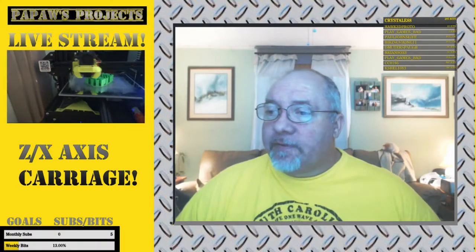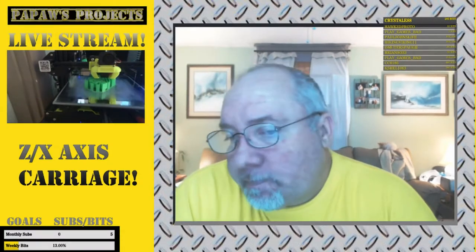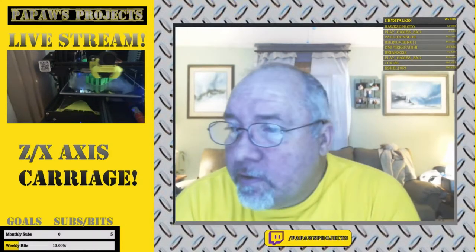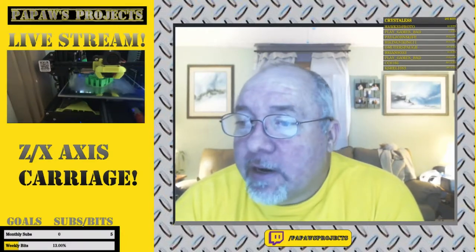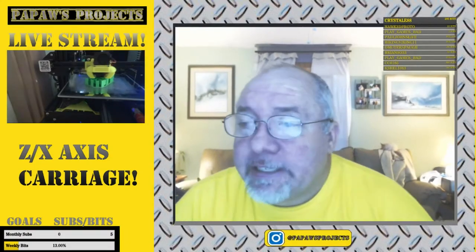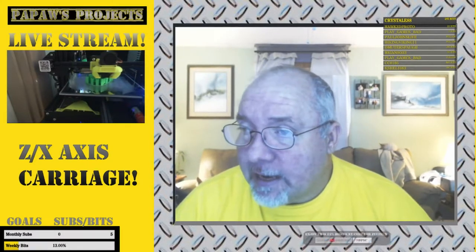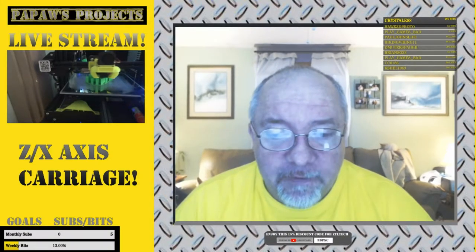I need to keep working on Fusion 360 so I can make fewer mistakes and be more efficient with my time. I bought two more rolls of that same green filament and I've almost gone through one of them just in rebuilds of the carriage. I found out a lot of it was my own fault — I was making them way too thick, thinking I was making it stronger at 80-90% infill. But the one that ended up printing was only 10% infill and it's strong. I was wasting a lot of plastic, but I've only been doing this seven months.